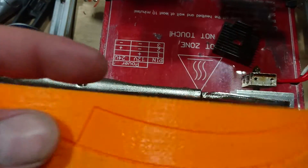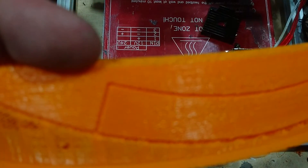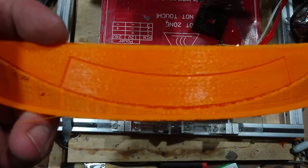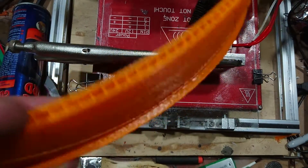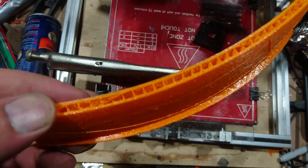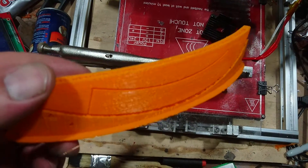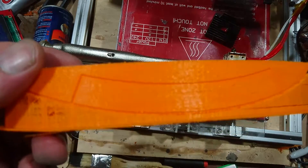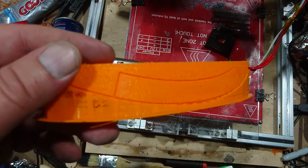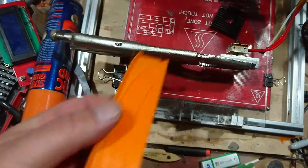When I came home there were two prints that I had going. Here's the other one that's not broken, but you can still see - it looks ugly, it's not very pretty. You should never get something that comes out like this on your 3D printer, with holes in it. Basically what that is: as the filament gets heated up, the water in the PLA vaporizes and turns into steam out the end of the nozzle, so it pushes all the little pieces out and you get a finish that looks like that.